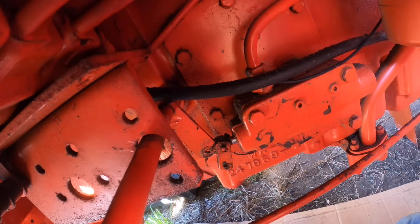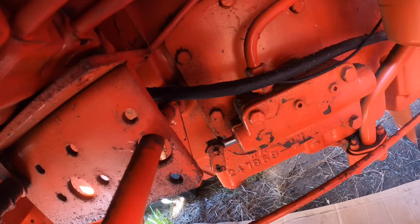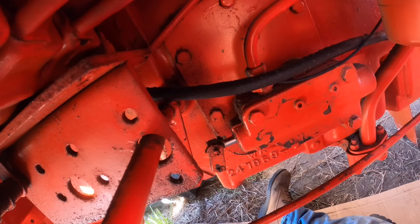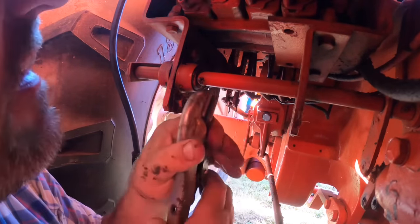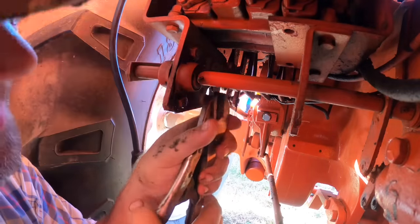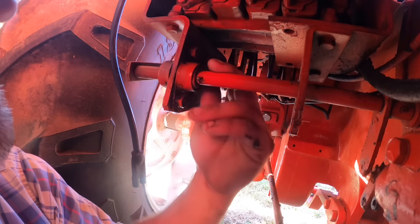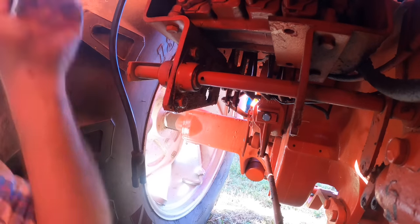Probably would be better if I shifted it so that it's out of there. How's that look? That might be more better. This is the high/low valve — it sends hydraulic pressure in there to lock up those clutch packs. Now I'm going to start by trying to take this out and see what kind of luck we have. Okay, we're having moderate success.